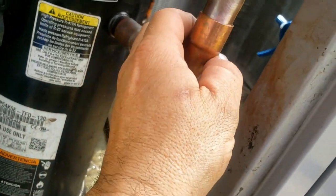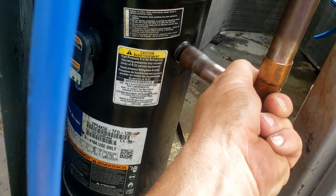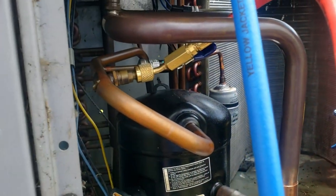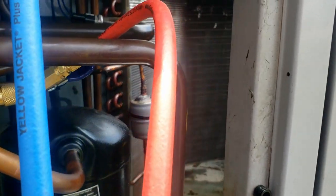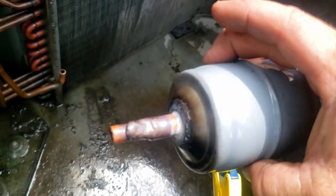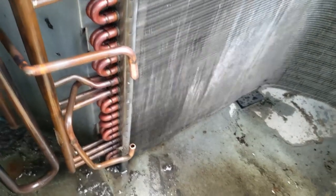All right, it's in there like a glove. Did a little purge here through the suction side, blow it out through the discharge side, get it all out of there. We get this brazed in and we're going to change that filter dryer too — it's a 2007, might as well get it changed out. Looks like it's probably the original dryer even though it looks like it's been burned on a few times. Got the filter dryer out of there — it's been changed at least once.